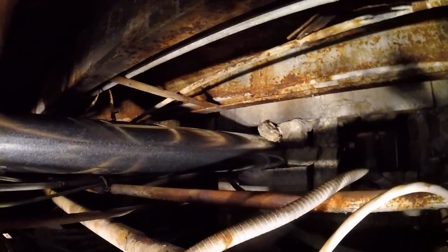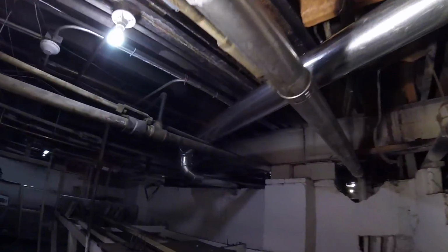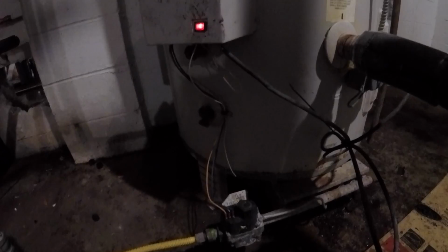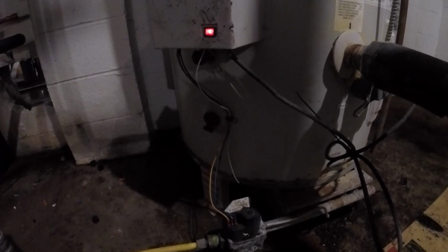All right, things got a little hectic. We're getting this chimney cemented by the concrete guy. The new pipe is in, all the way to the old hot water heater. So I was going to start the other job, changing the pipe for the Rinnai. I go to fire up the heater, and the heater was off for like a week, and it was condensating like crazy, and it wouldn't fire up. So I had this whole thing apart, and I called tech support, and the igniter was soaking wet, so I had to dry it out, and it worked. I dried the whole area.